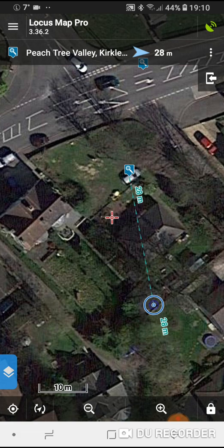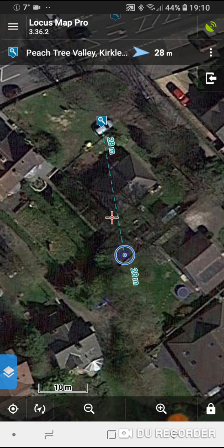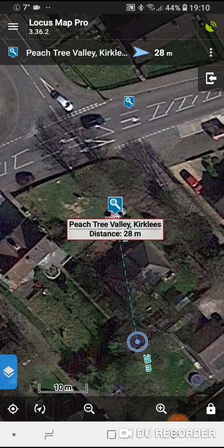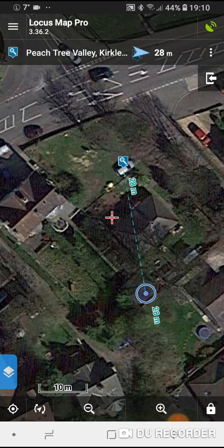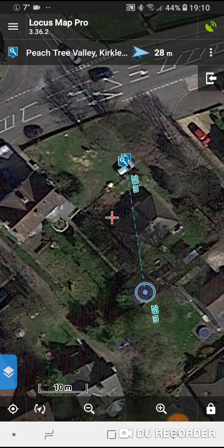When you're driving your boat out, you'll be able to see your boat going across the screen. This blue circle will turn to an arrow, and you'll be able to follow that line straight across — it will tell you when you've arrived at that location. To turn Guide off, hold down on the box, click on the arrow at the side, and click Guide Off.